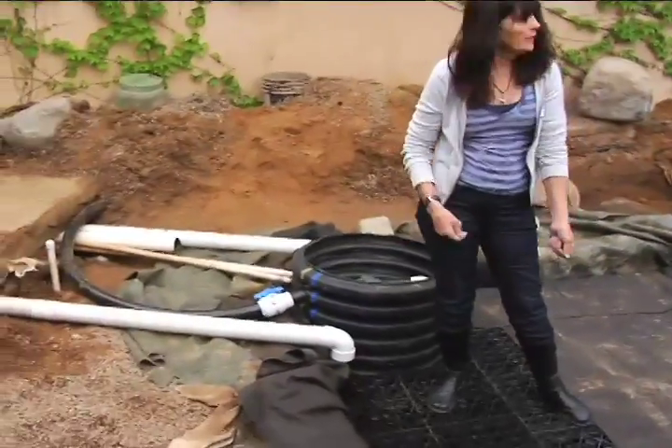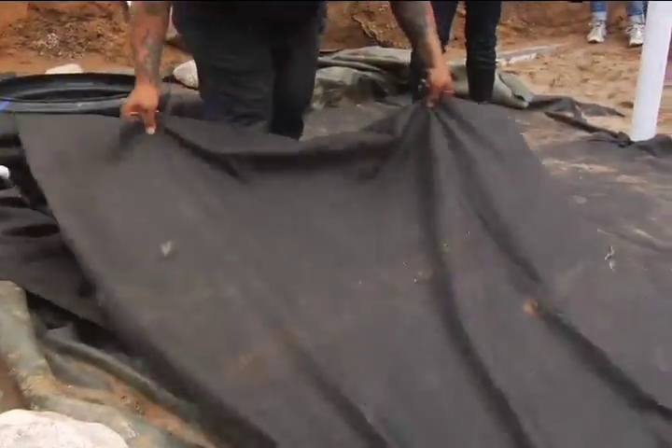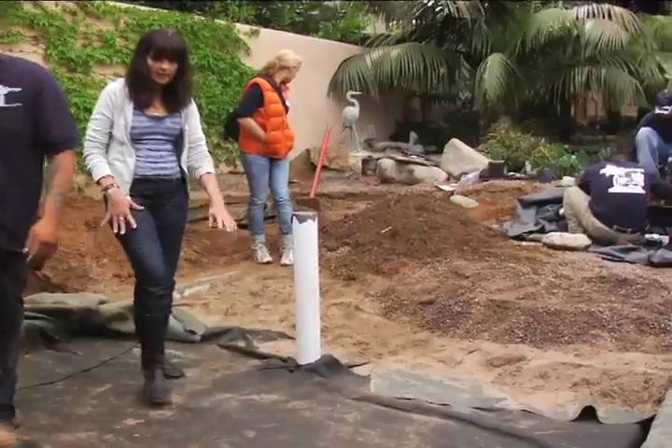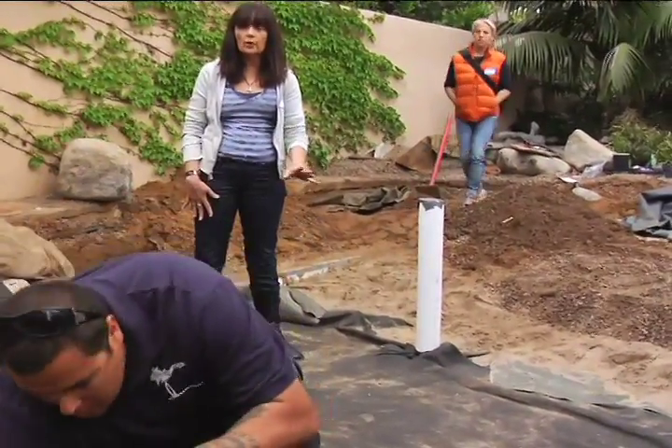Now we're going to pull the fabric up over it. We've pulled the fabric over, pulled the liner back over the top, and laid sand on top. You want to make sure that you get sand touching any time the geotextile fabric is in contact with the soil — put sand down first. That'll maintain the integrity of the geotextile fabric, allowing it to stay open instead of closing up with silt. They can put gravel — anything that's not sharp, you want a rounded gravel. They'll go up at a minimum of 12 inches before compacting with the vibrator plate, then bring in another six to eight inches to get it to the desired grade. The contractor will come in next week with rebar and lay the patio down on top of that.